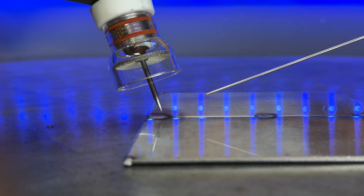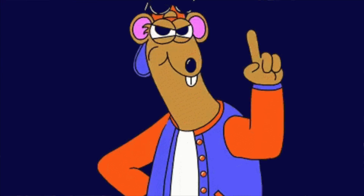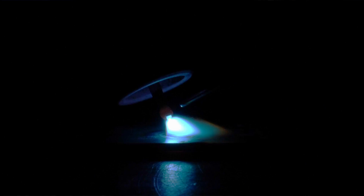This almost all the time will cause the filler material to stick and grab to the workpiece. Also, somebody might think they need to introduce the filler material more towards the center of the puddle. This is going to do one of two things: first, it might cause you to pull your standoff distance back — we just talked about why we do not want that. The other thing that's going to happen is you start to introduce the filler material more towards the center of the puddle, and it hits the tungsten electrode. So we can see why feeding to the center of the puddle presents as many problems as the leading edge of the puddle.